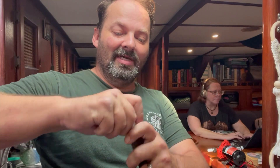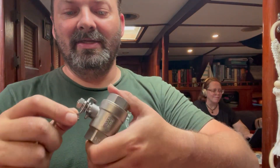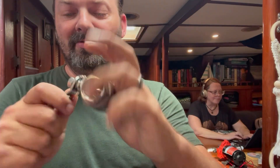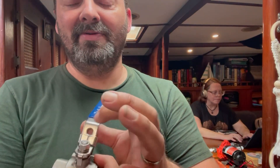Our old toilet used raw water or sea water to manually flush with a manual pump. So I have pulled the raw water hose out and we are going to cap it with this elbow and then add this stainless steel valve. This valve is special — it's what they call a locking valve. You turn it to the lock-closed position and slide this piece down, which prevents you from being able to unlock it. We'll throw a zip tie through here and mark this as a raw water valve. This will be important for a future project where we may need something that uses raw water, so we don't want to completely remove this connection — it's closed off but can still be opened if needed in the future.